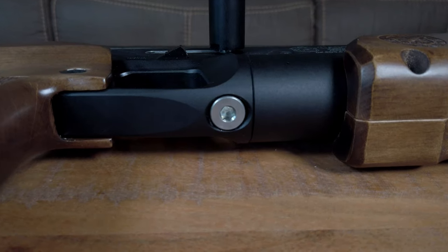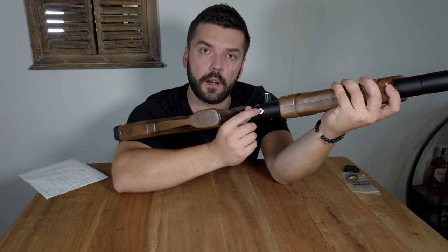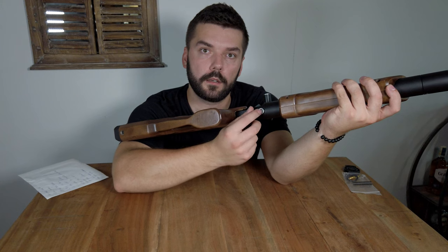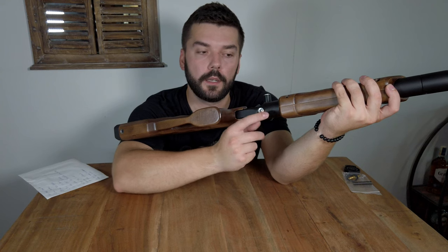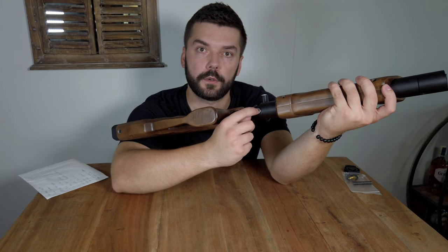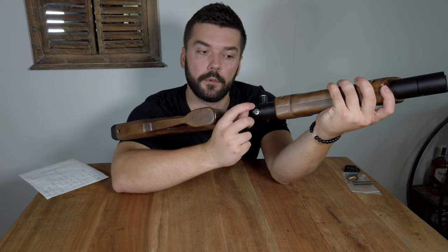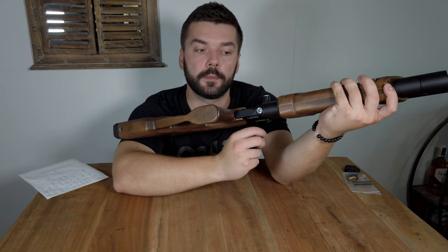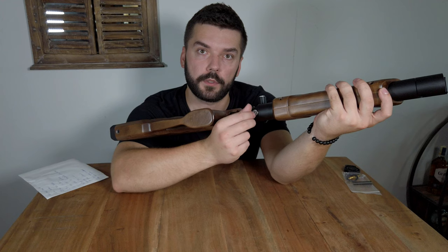From the bottom side you can find a silver screw which serves to empty the air tank. Keep in mind that you just have to turn it half a turn slowly to empty the tank, and then when it's completely empty, unscrew the screw all the way out and fix the o-ring on it. If you don't unscrew it fully and fix the o-ring, and just tighten it back, you will break the o-ring — so keep that in mind.